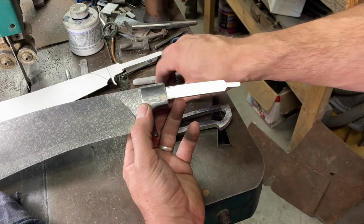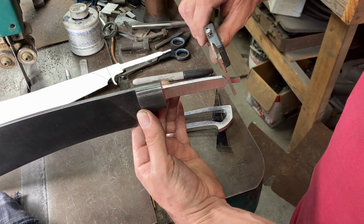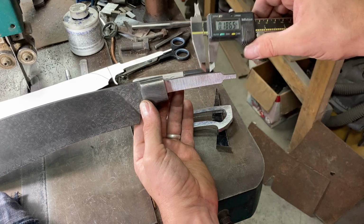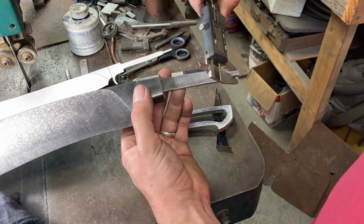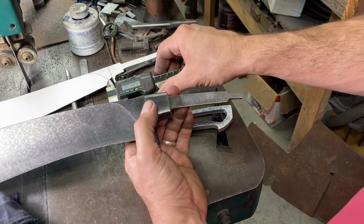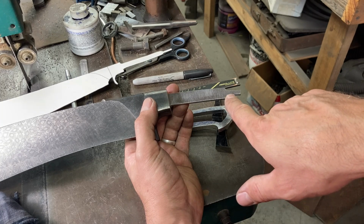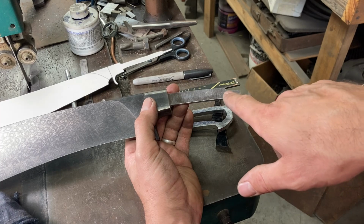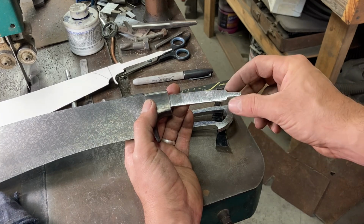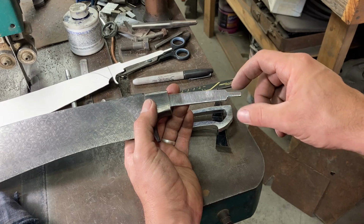Now, dimensionally, let's take a look here. So that's at a 1.86, and then this way we're at 203-ish. So I'm going to thread this for number 10, probably a number 10 fine thread, that is 10-32. It's going to be either 10-32 or 10-24. Either way, that's an outside diameter of 190 nominally, so we are just a couple thou per side under spec for that.